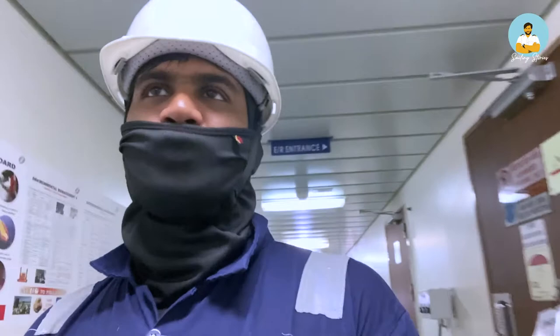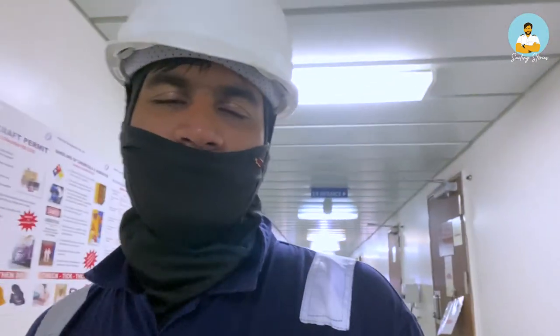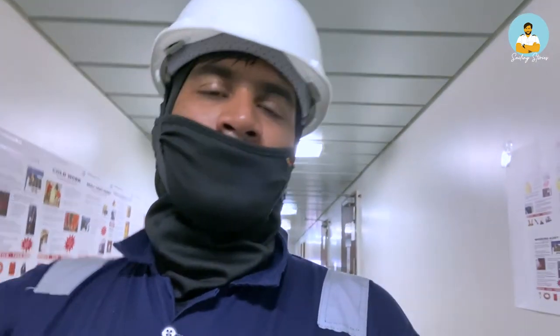Hey guys, so I have finished my hydrant greasing job today. I have done a total of 8 hydrants today. The starboard side accommodation, all I have finished. So you saw what is the proper procedure for cleaning the hydrants and lubricating them. I prefer lubing them with lube oil. Some people prefer greasing. It depends from person to person. Both are proper procedures.